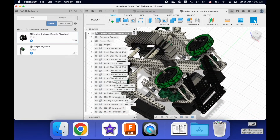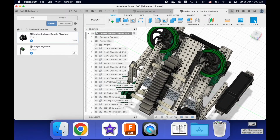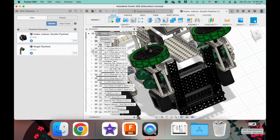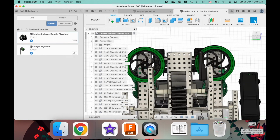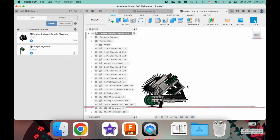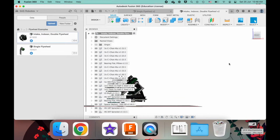Okay. So how does a flywheel work? Well, first we usually have some kind of indexer system that brings a game element to the flywheel. And we have many different types of flywheels, but I'll just first explain how this particular one works, or in kind of general terms. A flywheel involves spinning a wheel at a super high speed so that when a game element makes contact with it, it shoots the game element out, usually as a projectile, so that it flies in the air and goes towards something, usually traveling in some kind of an arc.